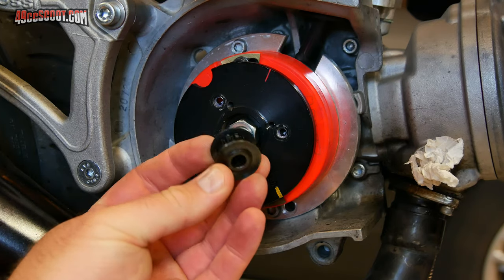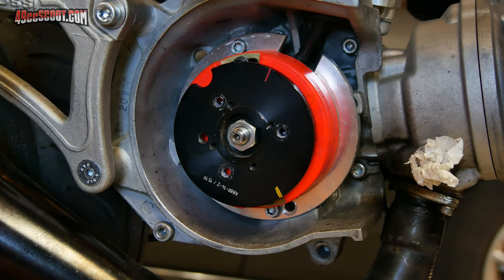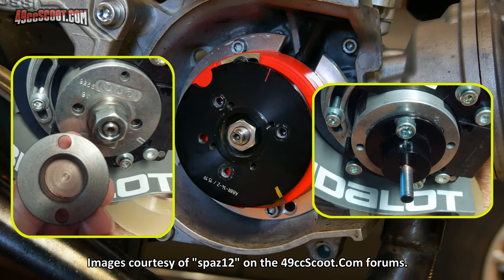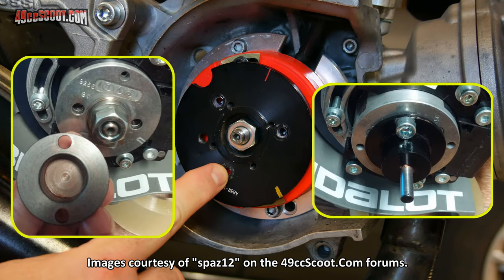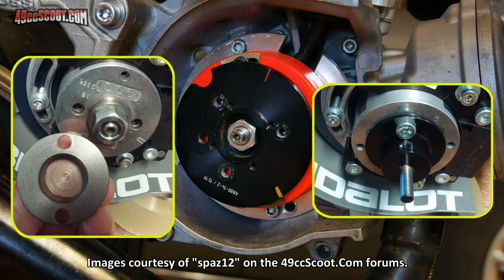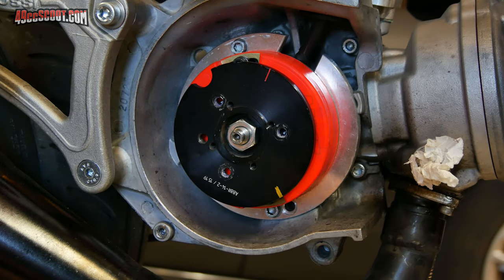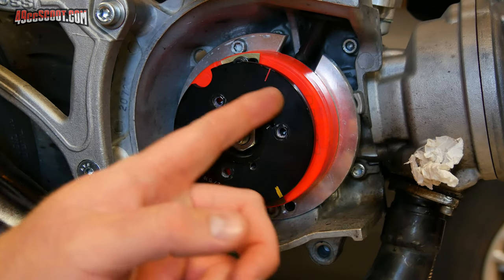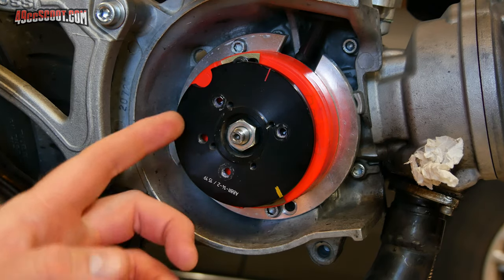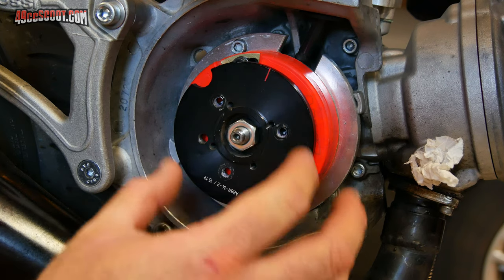Now I need to try and figure out how to mount this pulley so that it can be driven by the crankshaft and drive the water pump. My initial thought was to do something like I showed you in the last video with Larry's setup, where they made a piece that bolted on to the rotor, and then there was the shaft out here where the pulley could mount to. My issue with that is that I was considering using these bolts here that are normally for the fan or the water pump drive, and that would take about a 2.5 inch diameter to make a plate that large. What I actually wanted to do was to make it out of one piece of steel and machine it all on the lathe, because I figured that way everything should be able to stay true.